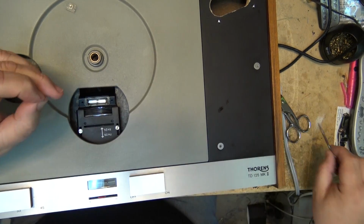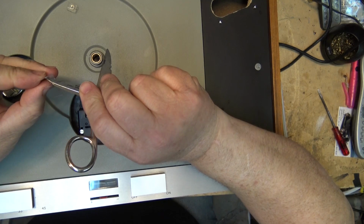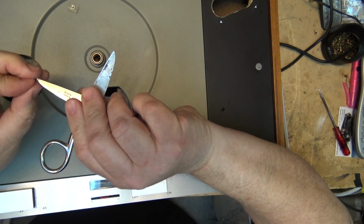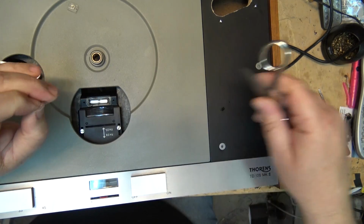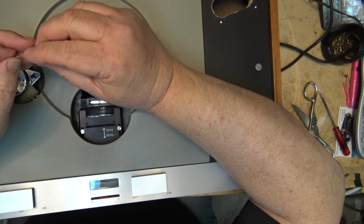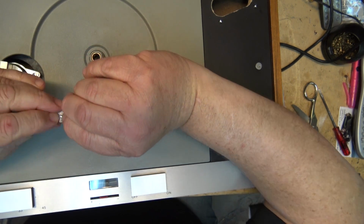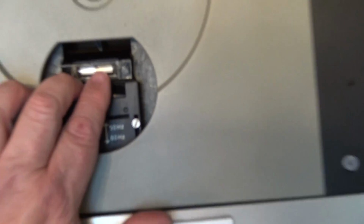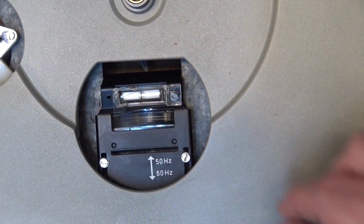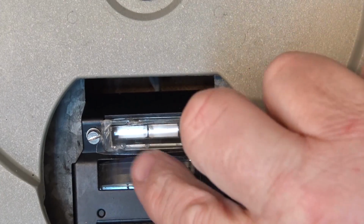It's going to punch a hole in the plastic. I used my soldering iron to melt a little hole, and I'm just going to enlarge it a bit now so that I can get a screw through there. I just want to measure the distance that I need to punch the second hole. I'll put the end cap on here. As you can see, I've fastened it down on one side. So now the other end cap, I should be able to stick it down on here and just squeeze it down in place. Okay, I've got my cover in place here.